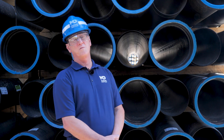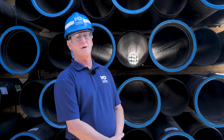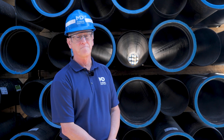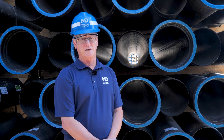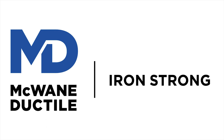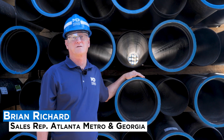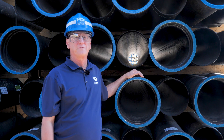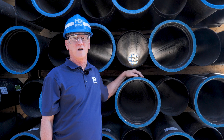Over the past several years, you may have heard a lot about applying zinc to ductile iron pipe as a means of corrosion protection for extending the life of the pipe. Today we will explore the history and efficacy of using zinc on your ductile pipe. Hello, I am Brian Richard, the McWane Ductile sales rep for the Atlanta metro area and most of Georgia. In this episode of Iron Strong, I will speak briefly about using zinc coatings on ductile iron pipe.